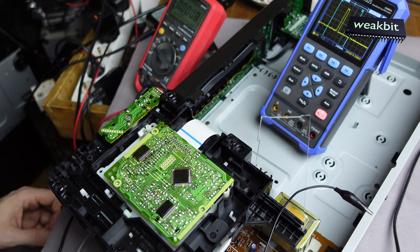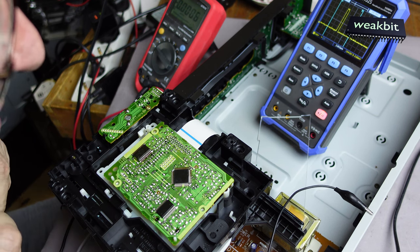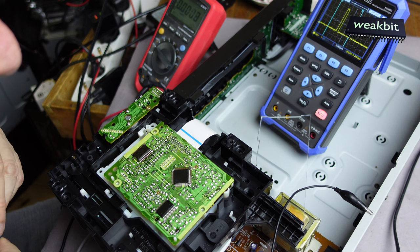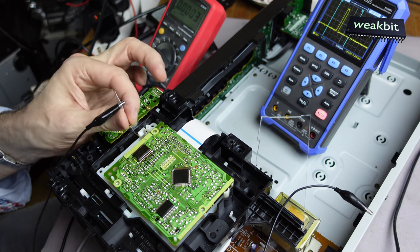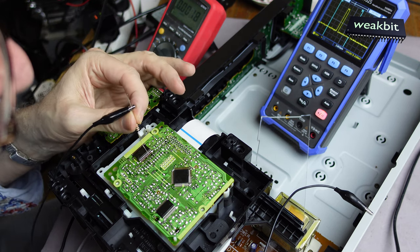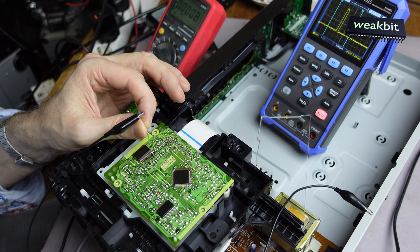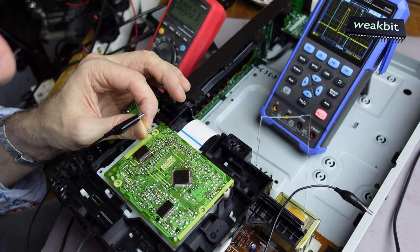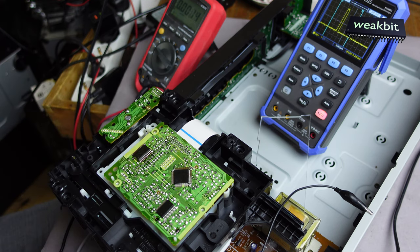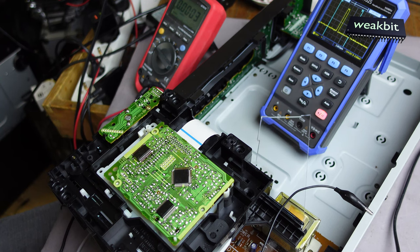But in the case of the spin motor, there is no possible way to spin the motor. The input is on resistor R725 — I have 1 kΩ to ground and put it there. The spin motor doesn't start. It doesn't spin. That means this IC is maybe defective. We order a new one and wait, then we can repair it.